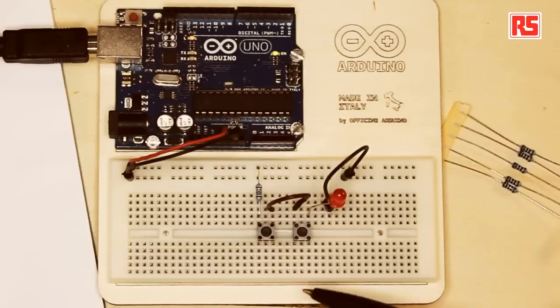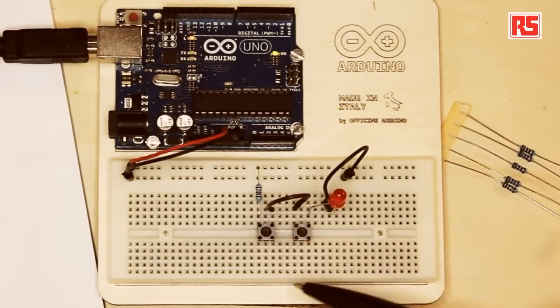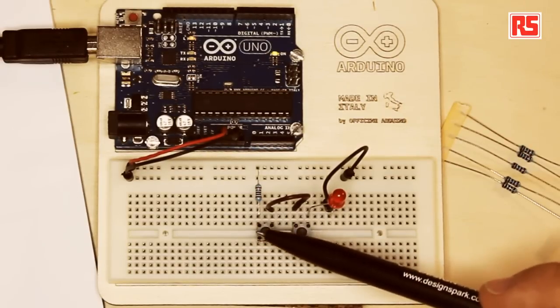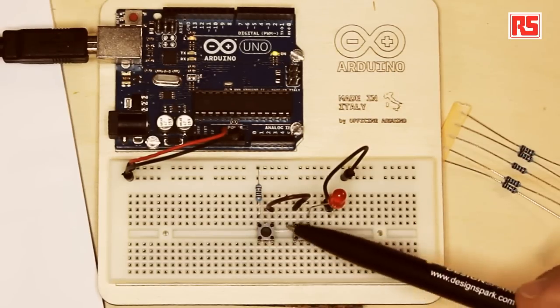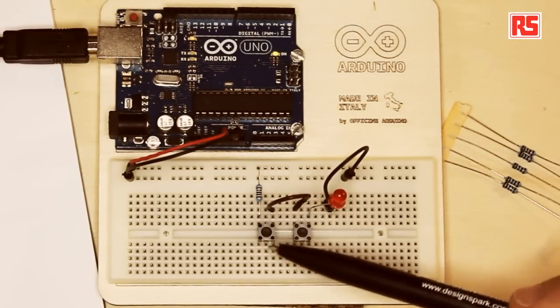What we have learned is that if we put buttons in series — one after the other — I need to press all of them in order to close the circuit and make electricity flow. Inside the push button, there are two pieces of metal separated by a spring. When you press the button, these two pieces of metal come in contact and create an electrical connection, allowing electricity to flow through them. When you release the button, the spring pushes the two pieces of metal away and interrupts the circuit. You will notice that the push button has four legs — at the moment we used only two.